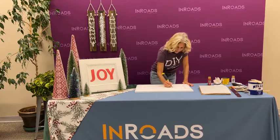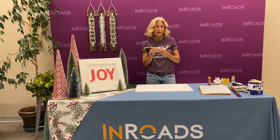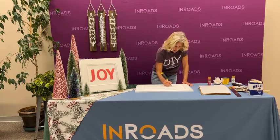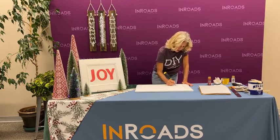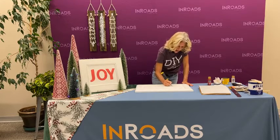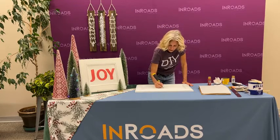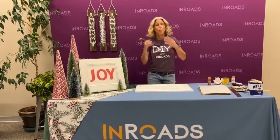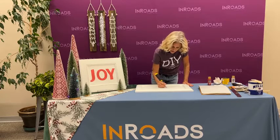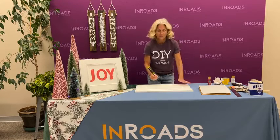Okay? And once again, it takes a little bit. I noticed I prefer to use a Phillips versus a flathead, but each to his own. Okay, and it just goes. You see, it just goes all the way around. Now, what happens here is this is going to start flaking. You're going to see some paint come up because it's going down into the wood. So when you're done with that on all of these, when you come around, you definitely want to wipe it off, because you don't want to have this leftover paint, these little frayed bits, go into the red paint.